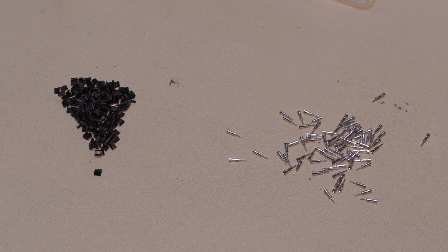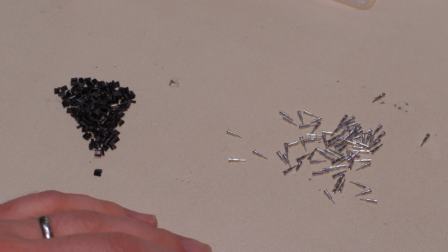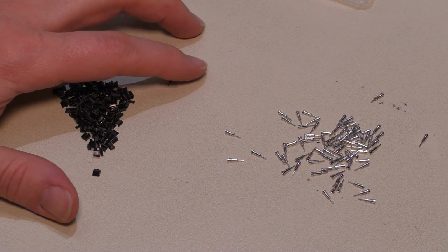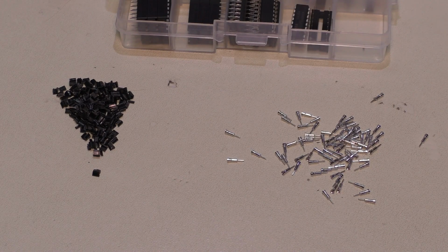And the other thing I failed to mention is this surface we're working on is an anti-static mat, and I'm also in bare feet. My house tends to generate a fair amount of static electricity, especially during the winter time, and I want to mitigate that. So of course the mat's in place, so when we work with our ICs in here, we're not actually shocking them out.